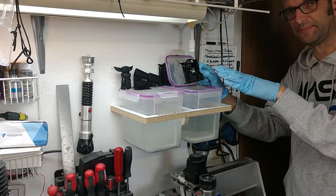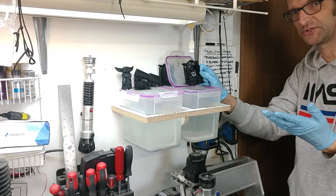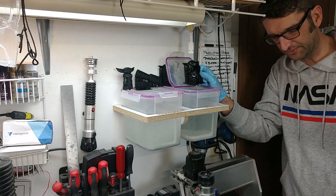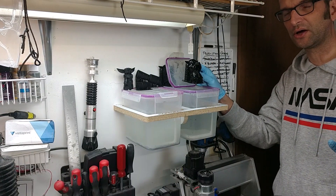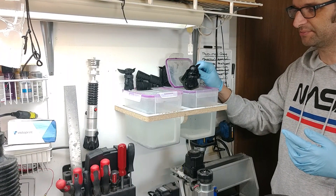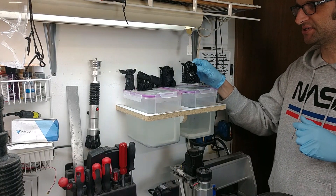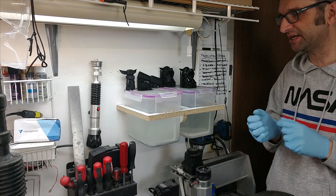After about 10 minutes in the first wash bin, I'll move it over to the second one and leave it in there for another 10 minutes or so. You can see that having those little strainer baskets in there is really nice because it lets you clean up your part well and agitate things. Get your print out and let all the alcohol drain out. The second wash stays nice and clean because we've done most of the cleaning in the first one. The reason I like to use IPA for the rinse instead of water is that water, unless really well treated, will leave hard water stains — minerals that get left behind on your print once it dries.